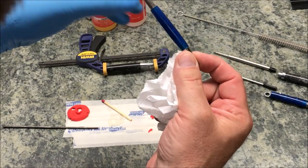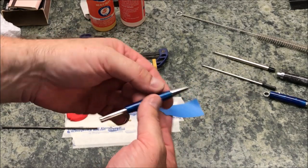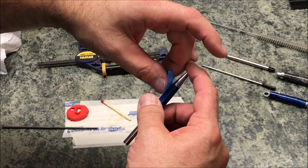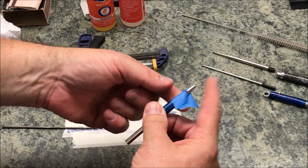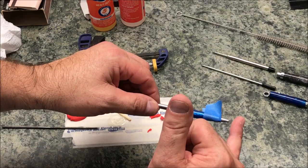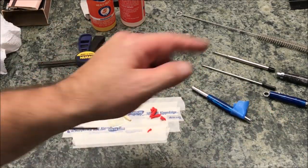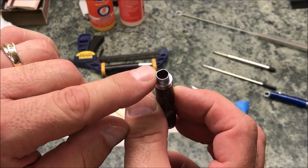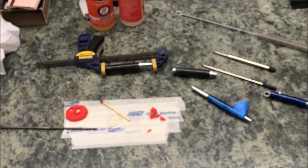By twisting as I roll it down, the epoxy rolled back under the blank and there is no epoxy on the outside. I grabbed a piece of painters tape to check both ends — it looks good. I'm going to put a piece of tape on the blank and push the nib in; the tape acts like a clamp to hold the blank and nib together. Then I'll get the area cleaned up. I also notice the back half of the blank has a little dent in it — we need to round that out.